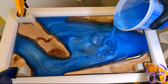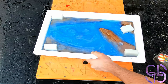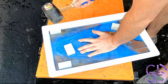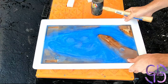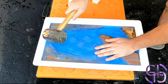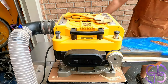Then I poured the top two layers almost immediately one after another. I think if I had waited a bit before pouring the top layer I would have gotten a better effect, but overall it still looked pretty cool. I let the whole thing sit for a week just to be sure it was ready. After two weeks total of working with epoxy, I smashed it out — first removing the small HDPE clamping blocks, then hammering the edges off, and with a quick flip I smashed the bottom as hard as I could and the board just popped right out. One thing I learned is that the walls have to be loosened first before you can smash it from the bottom, otherwise it won't pop out of the mold as easily. And now it was time to plane the whole thing to get rid of imperfections.